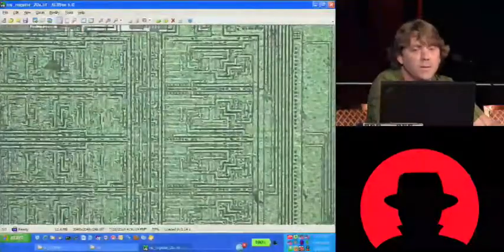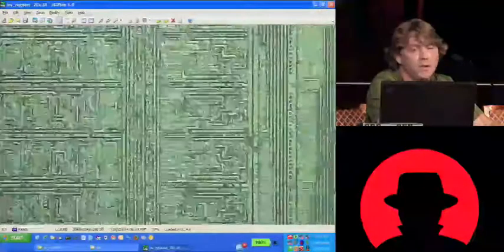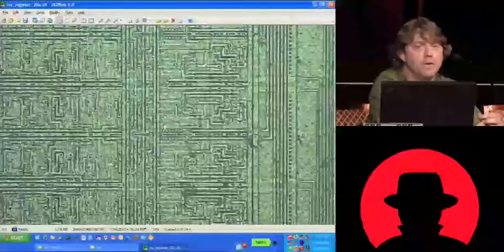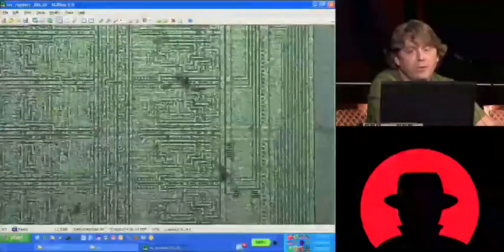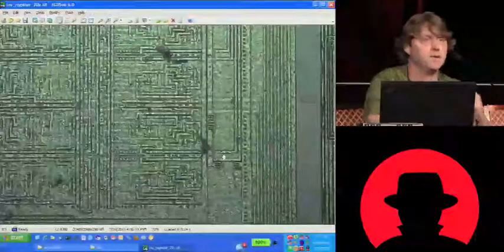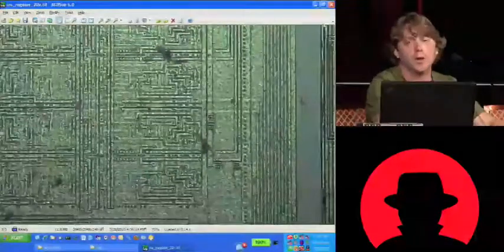And here you can see one of these is like set and reset for the flip flop. And so you just check them, and the one that's holding the opcode when it's low, stable, is the one that you want to freeze. And so there's your 8 bits. There's 2 more, and there's 2 more. If you sat on the data bus right here, you'd see the opcode that they're executing for the entire cycle of the amount of cycles that instruction took.